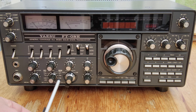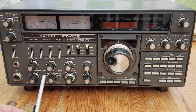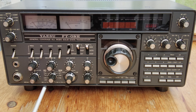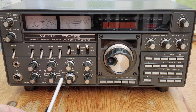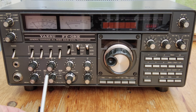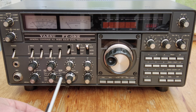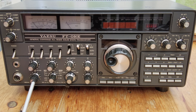The mode switch is labeled FM, AM, FSK, upper and lower sideband, and three CW positions. Some of these were options - the rigs didn't come fully filtered from the factory. This radio has AM and FM fitted, which I believe in some regions was an option. As far as I know it has only one CW filter, and the AM filter is the narrower one - there was a wider option for AM. Then we have the delay and key controls for CW.